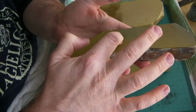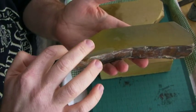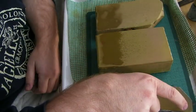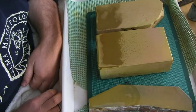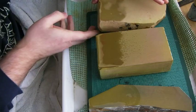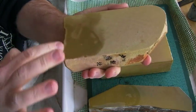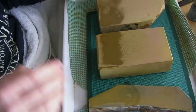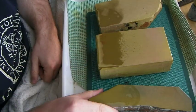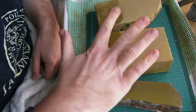If you wait just a couple of seconds, you can actually see that the stone is almost completely dry right here — it's really sucking up quickly. This stone, in the middle, is still pretty wet. What that indicates, as I said before, is that the stone drinks up water quickly.